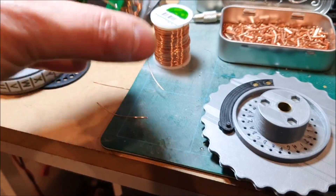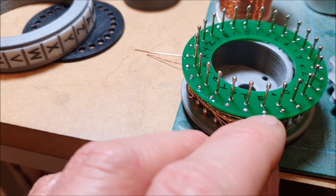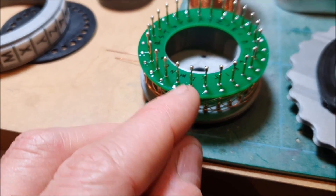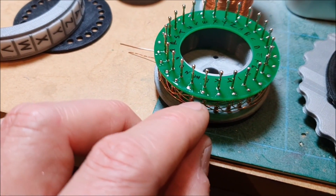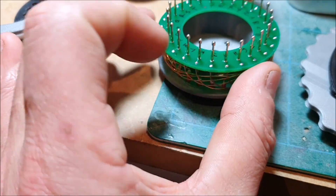But I don't want to do any of that until I've actually insulated around the wires. The other small detail that I hadn't really thought through is you can't poke the wires too far through these solder pads, because I haven't made provision in the rotor to allow for those wires poking through. So what I've had to do is solder them in and then sort of push them down so they're more or less flush.